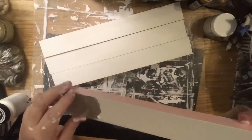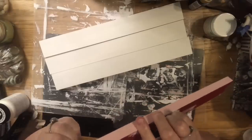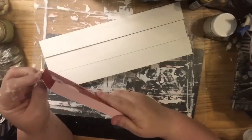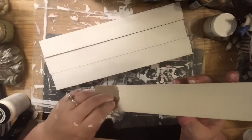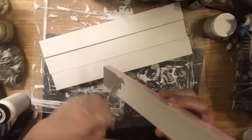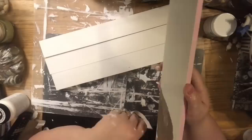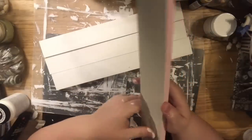Normally I peel this paper off, and people always ask why — it's a waste of time, just paint over it. Well here's the thing: if I can remove it with just water, then water-based paint is not going to like it at all. And that's exactly what just happened — I was putting on my second coat of water-based paint and it's peeling like crazy. As you can see, I basically just wasted some paint.